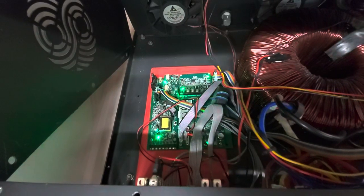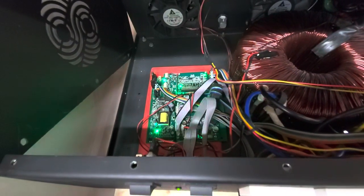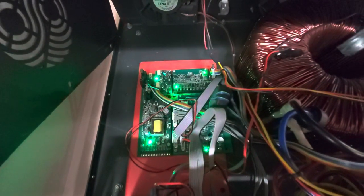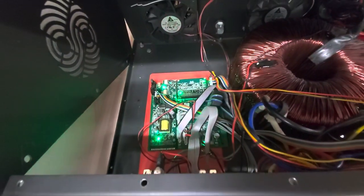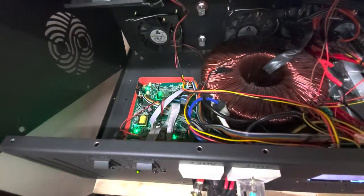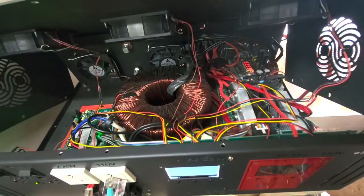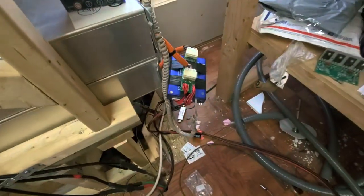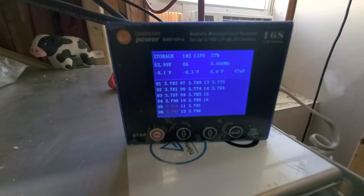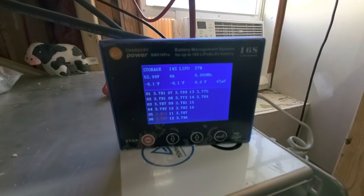If something were to fail I'd likely just replace the whole control board rather than a single part — I've got parts up the wazoo, so I'm in a unique position. As far as I'm concerned, all these little green LEDs can go to save power. You can also see my little BMS contraption — the cells are finally starting to come down and be more balanced. It's down to 47 millivolts; I've seen it as low as 42, so they do seem to be doing something, though it's taking a long time.